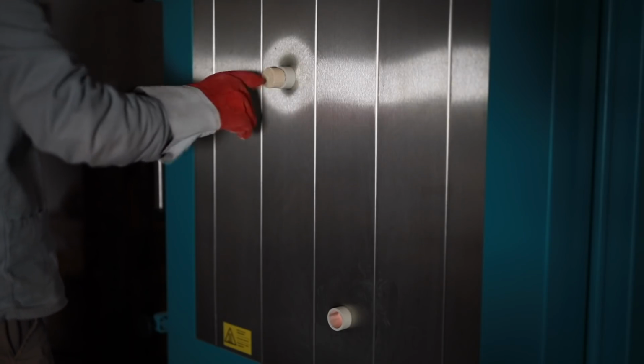And in this little clip here, you can just about see the cones through the spy hole, so this is what I'm looking for when I look through them. And finally, I slide the dampers closed fully, and I put the two bungs back into the spy holes.